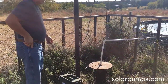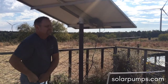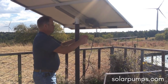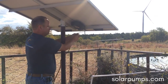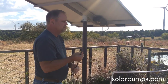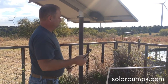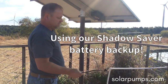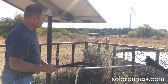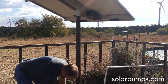Since this system is sitting near the wind generators, which were put up after the solar pump was installed years ago, the shadows off those generators are hurting the pumps — pulsating them under a heavy load. What we are going to do is put all the power into a battery pack, and then the solar will be charging the batteries so that pulsation will not matter.